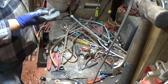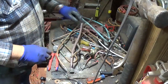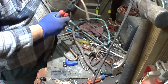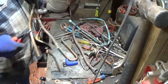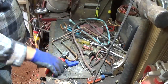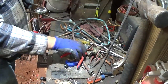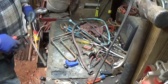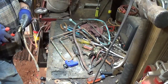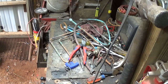Ninety-nine percent of the time they're brass, just chrome-plated. Most of this will be number one. I've got a solder joint right here, so I'll cut down to that — and of course with the solder on it, that'll be number two. I'll just take that off and throw it in my number two bucket right now.